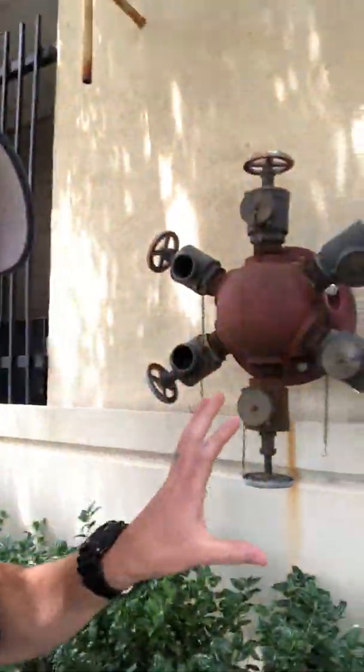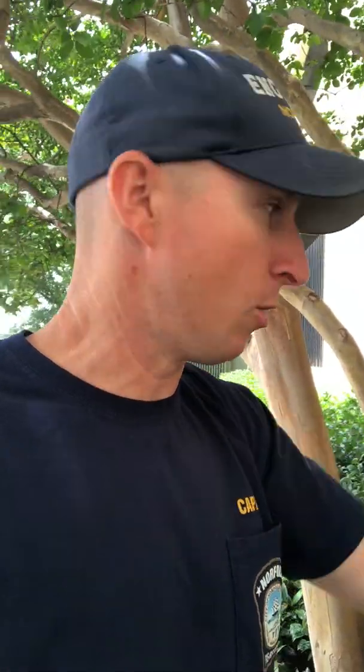So you would obviously need some fittings, like some double females, to put on there so you can make it an inlet. How do we take it from a discharge to an inlet? On the other side of this wall is the fire pump room. In most designs, there is an isolation valve in that fire pump room. If you were to walk in that fire pump room today, every other control valve for the fire protection system, for the fire pump, the risers, for the sprinklers and standpipes, is in the open position except for one. The isolation valve for the test header is in the closed position.